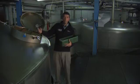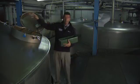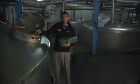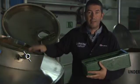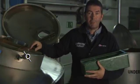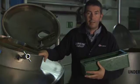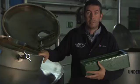When that's done, we take another flush and recycle it back to one of the heating tanks behind us. What this does is recover any sugars and flavours left in the grist and recycle them back into the next mash. The last part of the process: the rake arms in the lauter tun start to go counter-clockwise, pushing the spent grains — or draff — out through a hole in the floor to the big grey tank out the back. Lorries then come in and take this away to be used for cattle feeding on the island.